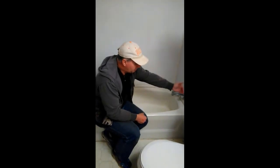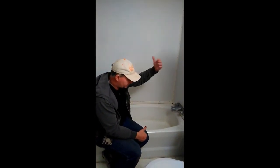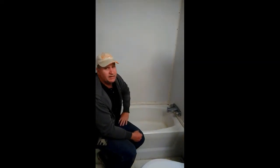If you want to use a house-type tub in a mobile home, you'll have to move the wall four inches. Your 60 inch tub is not going to fit in a 56 inch hole. So it is a little bit of an ordeal, but it can be done.